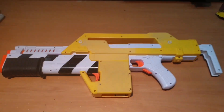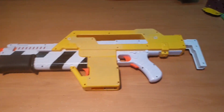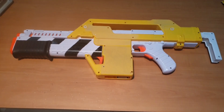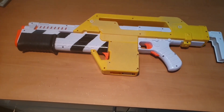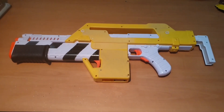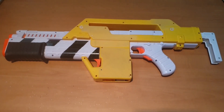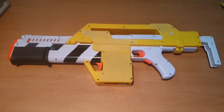What I'm hoping to do with this is put in a larger speaker with a little amplifier so that it makes it much louder than standard. I have a little voltage adjustment board to regulate the voltage going to the amplifier, and I'll probably use a MOSFET — which is like an electronic relay — to bypass the main electrics and supply directly from the LiPo battery to the flywheels, so they get maximum RPMs.